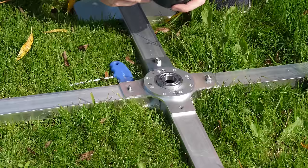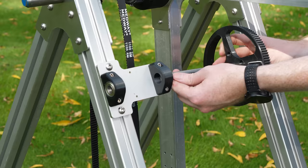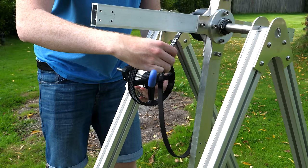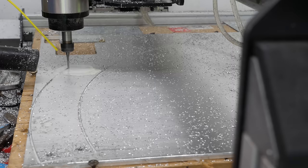There's just one problem — I need a method of spinning it faster. So I 3D printed a pulley which mounts to the arm. Then a timing belt can be used to drive it from an external source, and I mounted a secondary axle and larger pulley to the frame; using the slot nuts, the belt could be correctly tensioned. I can then attach a crank handle to the end of the secondary shaft and wind it up to speed. But first, let's build the flywheel.